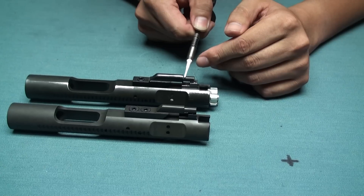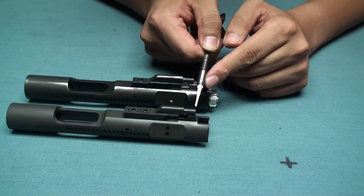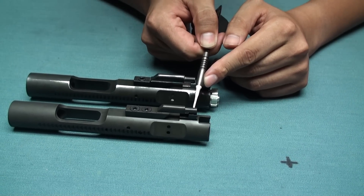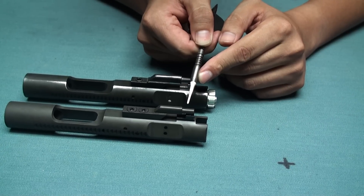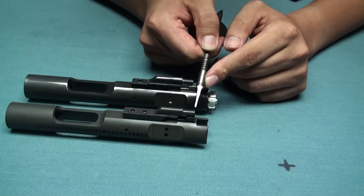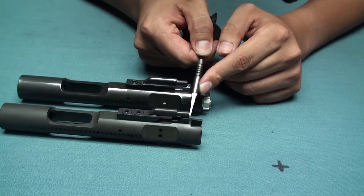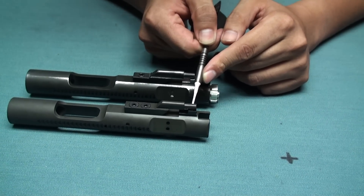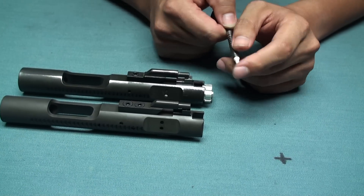The early version carrier key is a little bit shorter. We tried to build it longer because once the screw drive is loose or broken when you are firing, the nozzle guide might flip up, and that could damage your nozzle. So we extended the carrier key — even if it's not in the right place, it can still limit the nozzle guide nearby to prevent serious damage.